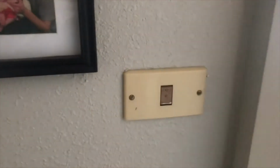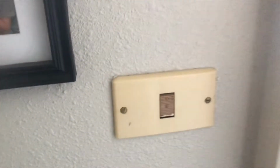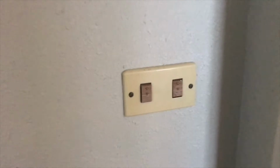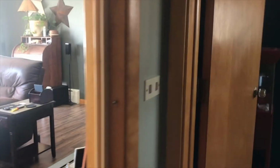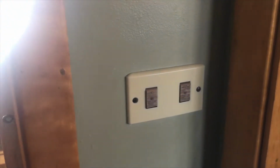We have these toggle momentary switches all throughout the house, which runs the relays that are in a central location. As you can see, we have probably 50 of these switches all over. They kind of act like a three-way switch, but you can have many more locations.